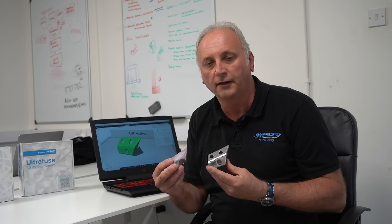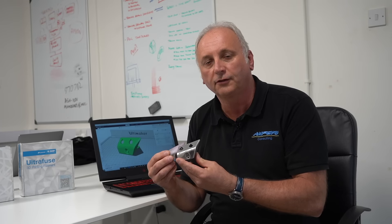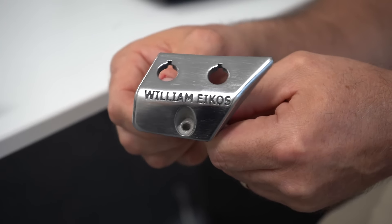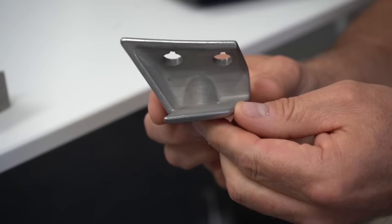The part that Medtech 3D printed has now been returned to us back from CMG Technologies, who carried out the debind and sintering process. The part that's come back has been very successful. You can see the setter that was created to aid the stability of the part through the debind and sintering process. With just a small amount of polish, it has produced what you see in my hand — a very successful final part. We're now going to send this to Medtech for them to share with their customer. If you've got an application that could benefit from metal filament 3D printing, get in touch with us at 3DGBIRE.